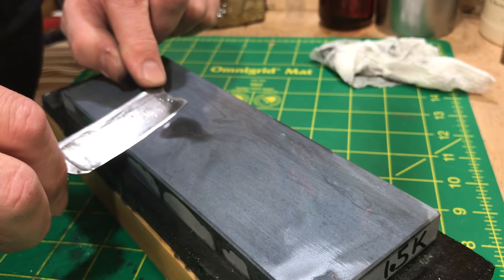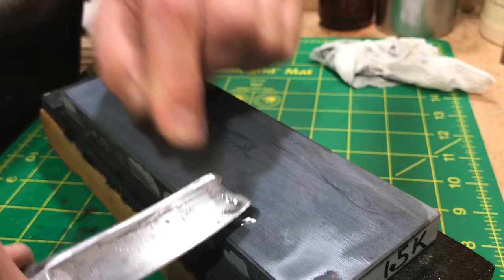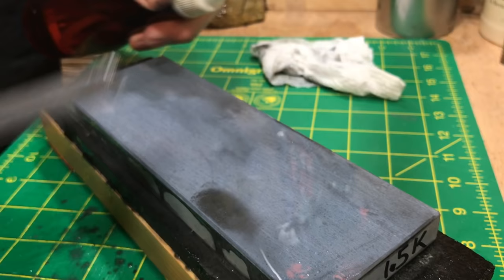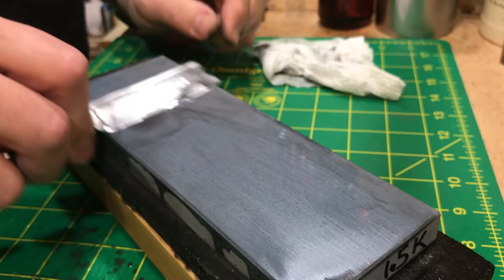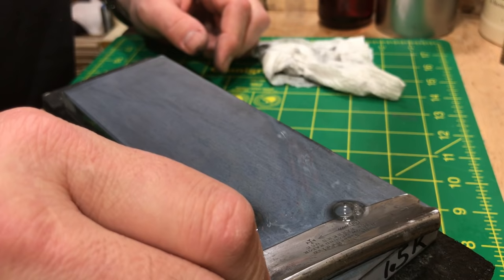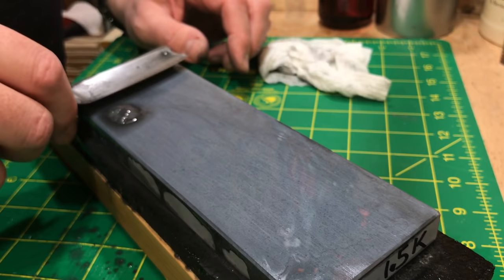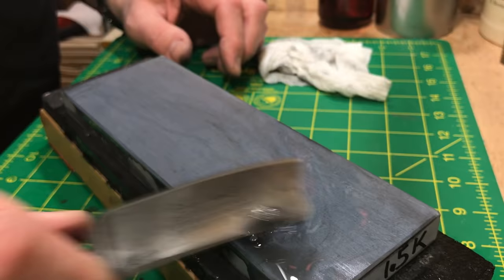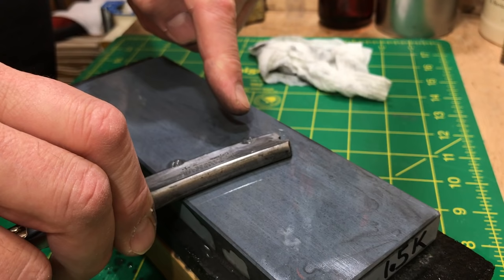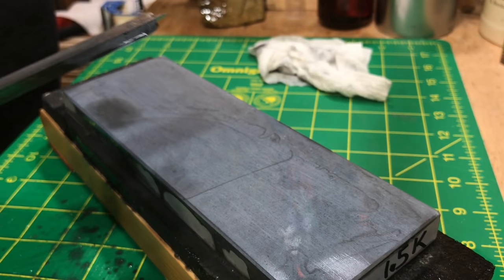I want to check the undercut — doing it really really slow. Still a little short on my undercut on the forward pass; it's not coming up as smoothly as I like. There's undercut and then there's undercut — I tend to run the blade to a point where I get what I call violent undercut. You have to be consistent in your approach: if you test at a bazillion different speeds you'll confuse yourself. Do it consistently over many sessions and you'll learn what your undercut looks like at a given speed, pressure, and swarf density — because particulate in the water changes things too.